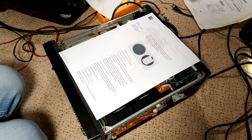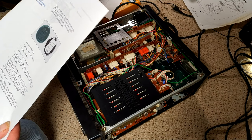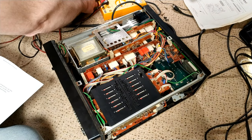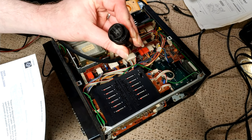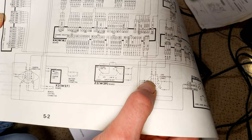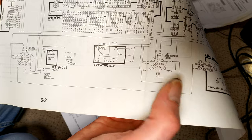Okay, so I've printed out from PalSite the connector pinouts, and initially it actually didn't help at all because this is actually wrong. It says these pin descriptions refer to the connections at the video end of the cable, so I'd assume it's the K connector here. But it isn't. It's actually the plug, which is that way round. What also didn't help was when you look at the circuit diagram, I was looking at the plug as if this is from the plug side, from the front, and it's not. It's fairly obvious that it isn't because the wires are going in to the back of the sockets.